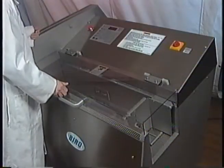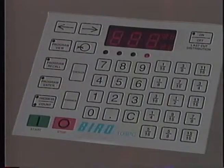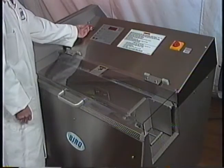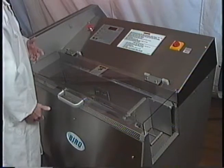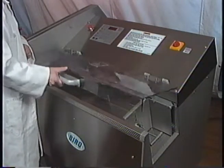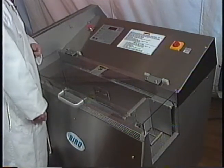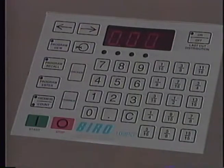Next, turn the main power switch on. The display will show all eights, and the far right LED will be on, showing the machine as needing to be reset. Pull the emergency stop up. Be sure all doors are shut. Lifting any lid will lift the loading chamber door slightly. Lowering it back down, the machine will reset into ready mode. The display will show 0.00.